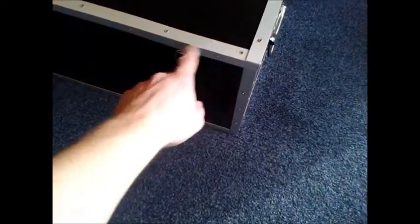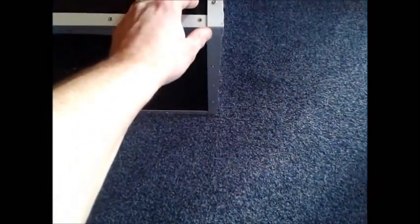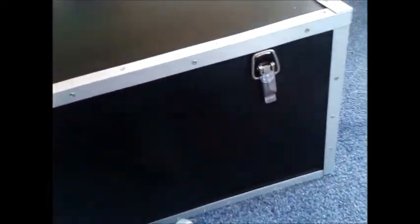As you'll notice if we take a closer look, to protect the lid and the corners of the box and reinforce it just that little bit more, I've installed some aluminium wear strips. These are right angle strips that are 20mm either side. I just used countersunk screws to screw them onto the wood itself. That will protect the corners from wood damage if the case gets hit. I've done it on the bottom too so it doesn't wear the bottom strips. It was around €20 or €30 to complete, with all the screws and all that.